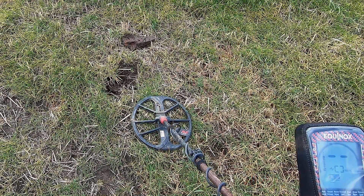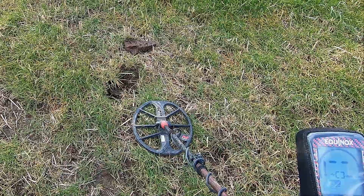What's happening is surface bits of metal near the coil, especially at high sensitivities, can be picked up from quite a distance — as you'll see in the clip, from at least 400mm away. So you can be that far out when you're pinpointing and not realizing what's actually going on. On very junky sites and Roman habitation sites, this does create an issue for people if they don't really know what's going on. I just made this little video to give you an example of edge detection with the coil and also how to pinpoint afterwards.